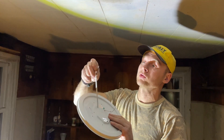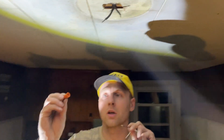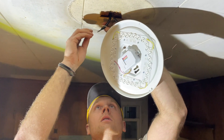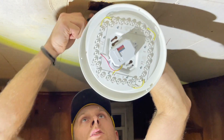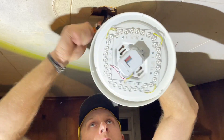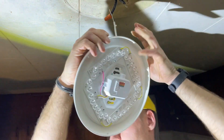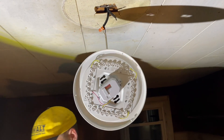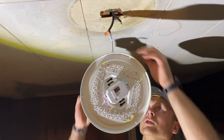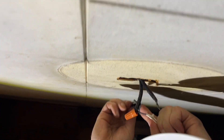That's why we did the testing — so now we know. Black is hot, so we're connecting it here. We're going to take our wire nut, match these up together, and then just twist it on until both wires wrap around each other. Pull to make sure nothing pulls out and you have a secure grip. We're going to wrap some tape around that as well, just for extra security. It's not necessary, but it's a nice touch just in case something comes loose.